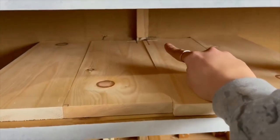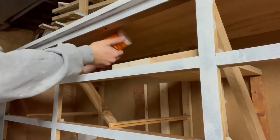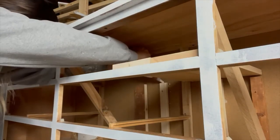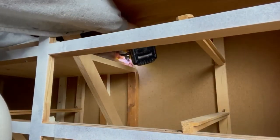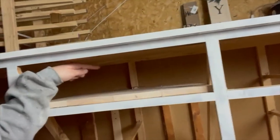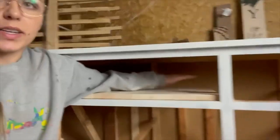This piece I still need to cut out a little bit on the back edge so I can slide it in. Now that the shelf is made, I got everything screwed in from the bottom, screwed in from the top to the supports, and screwed in the supports from the back. Then I made the pocket hole on the bottom with my Kreg jig to screw it into the base, so this shelf is not going anywhere — it's super sturdy and can hold quite a bit of weight.